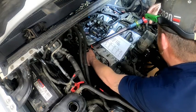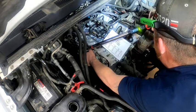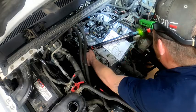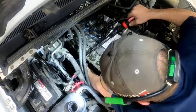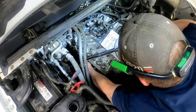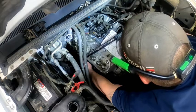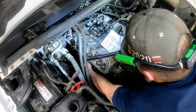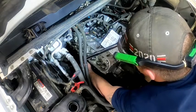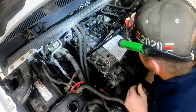A few things I do like about it — you can see that bright red light as you hit your target torque. As you're closing in on your target torque or target degrees, it'll start beeping at you, and that beep will become faster until you get a solid beep and that bright red light comes on once you hit your torque. That's really nice because you have both audio and visual warnings, other than just seeing the actual torque on the screen.